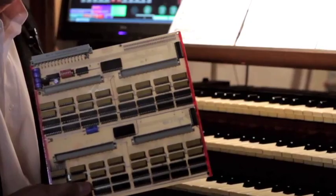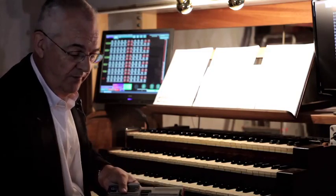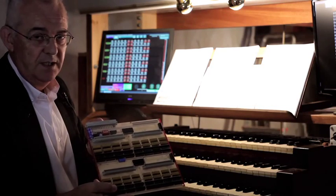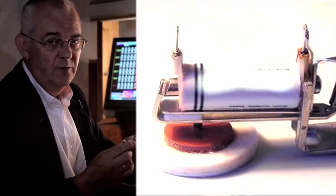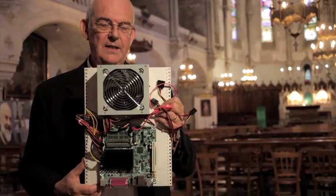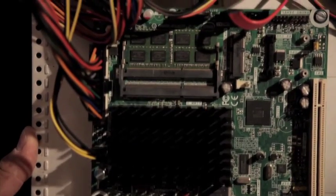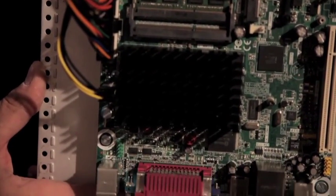For output and control of electronic magnets — magnet valves in the organ — I designed this board which can drive any number of registers. This board can drive 64 outputs, and here 236 outputs, and the magnet valves. With the second board I can drive up to 7 amperes per output. Any kind of PC can be used, even very small but efficient boards such as a dual-core PC, very cost-effective, whose cost is about 100 dollars.